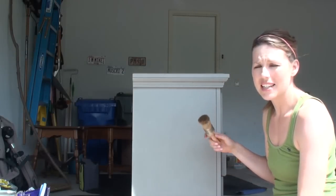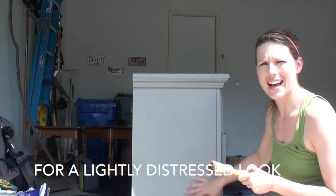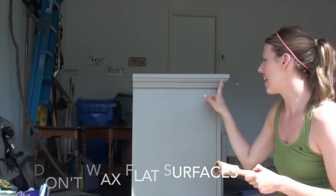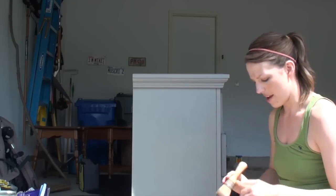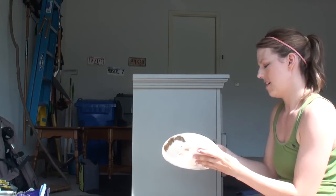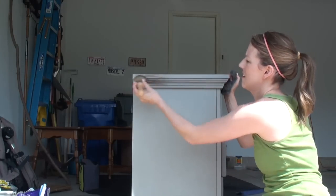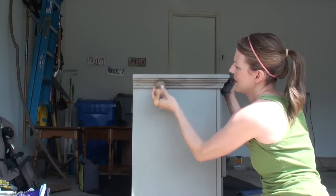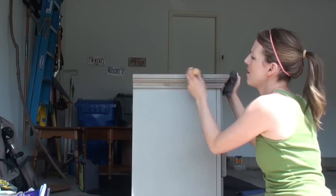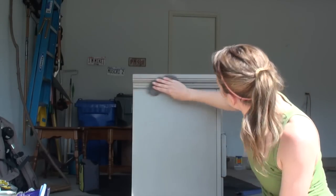I've now moved to the side of my piece with the dark wax. I typically don't do the flat pieces — I'm not going for a really heavily distressed look here — so I'm not going to do the side. I'm just going to go into the detailing of the top and bottom. The wax is really hot, so you want to try to keep it out of the sun and the heat because it melts. I'm just doing some detailing on the edge and the top, rubbing it in really well, then taking my steel wool again to blend it in.